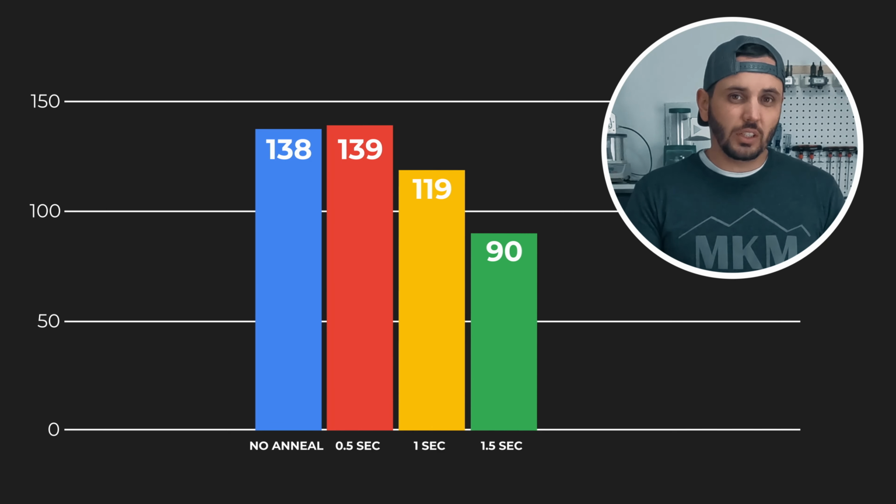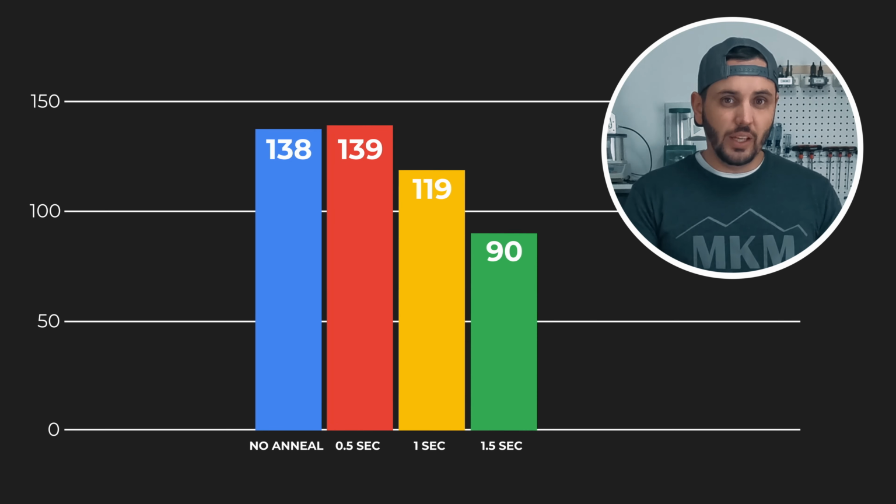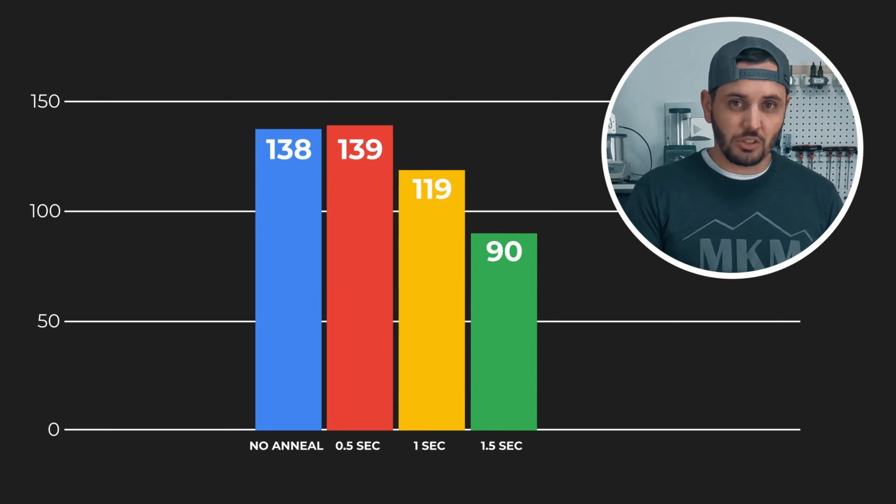What's also very interesting about that point is that the Vickers hardness measurement was about 90. And a lot of AMP's research seems to indicate that they are looking for that 90 to 100 range on theirs. And I'm thinking they're actually maybe in the 95 to 98 range, somewhere in there. Not exactly sure, but I'm pretty sure that's what they target with their profiles. Why is that? Well, maybe that's a discussion for another day.